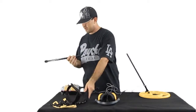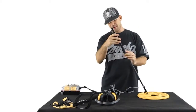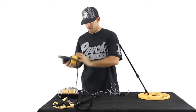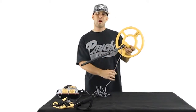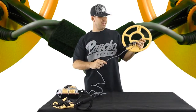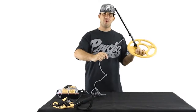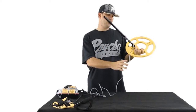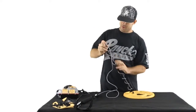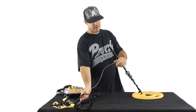Next we're going to put the lower shaft on — there are grooves here which these buttons will click into. I'll go ahead and wrap my coil wire around the shaft as well. You want your coil wire's first loop to go over the shaft — not under. If you go under, there's a possibility of false signals. That's what Whites recommends, and pretty much every detector company. Wrap the wire, then adjust the slack when you get to the control box and slide the wire up once you put the S-shaft on.